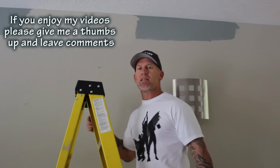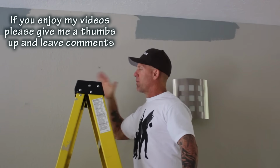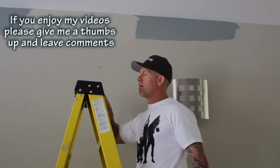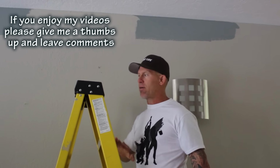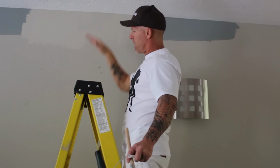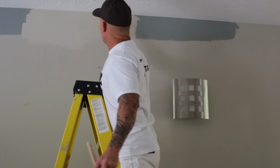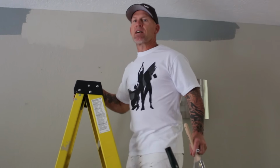And when I'm doing my cut-ins, I'm typically using either a 6-foot ladder, a 3-foot ladder, but I always want to have the ladder, or typically always have the ladder, I'm gonna walk up it at an angle like this, and I like to actually do my cut-ins with the ladder right here so I can face the ladder and lean up against the ladder and have myself supported.